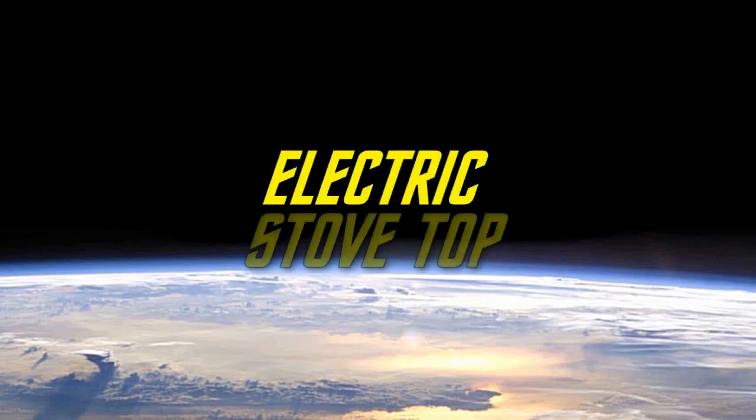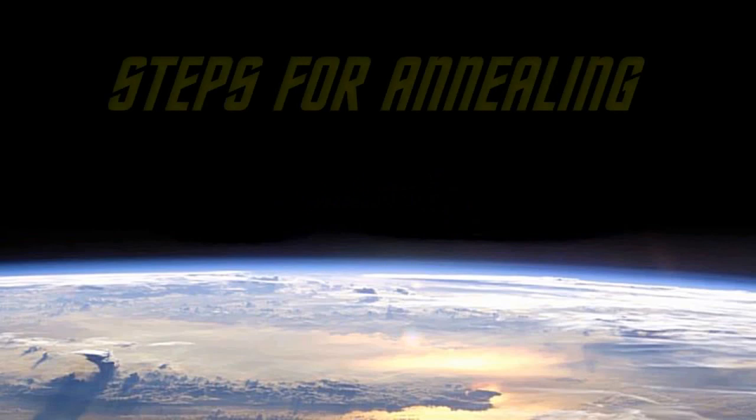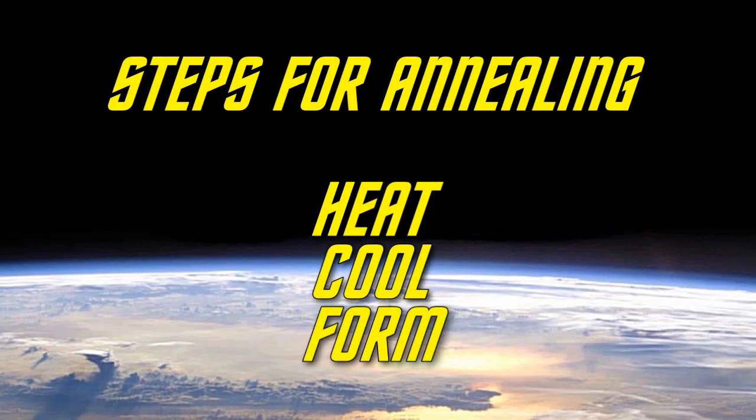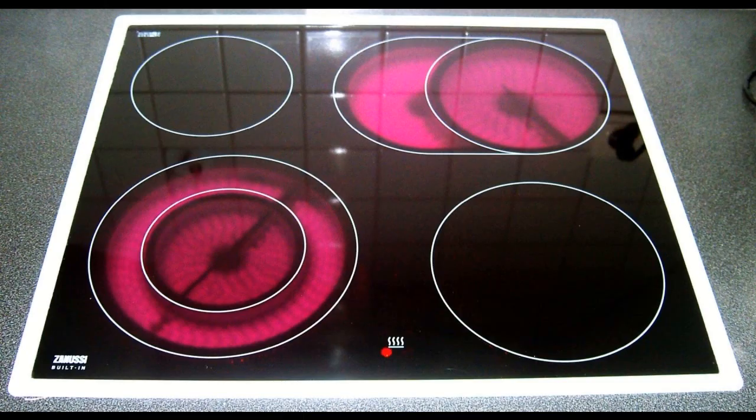Luckily, there's a way around this limitation: the electric stovetop. The steps here are exactly the same as with flame annealing. Heat the metal, let it cool, and form it. One quick note: glass stovetops generally don't get hot enough to anneal brass. Your local discount shop, though, may be able to come to your rescue.